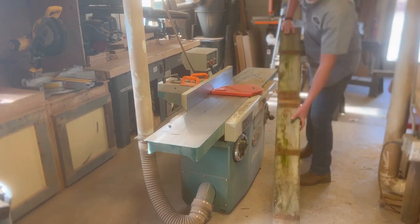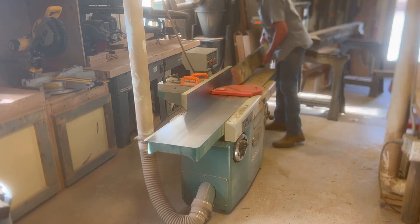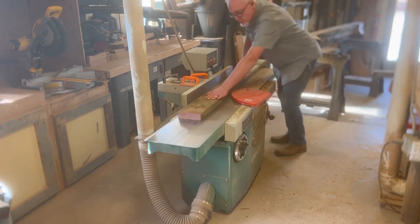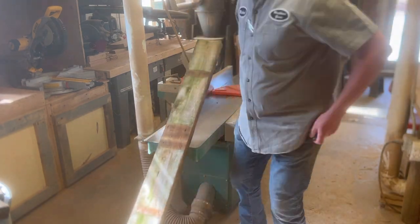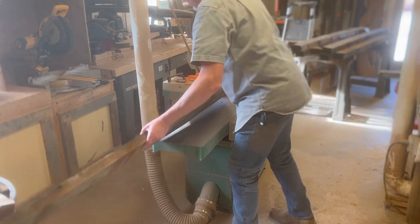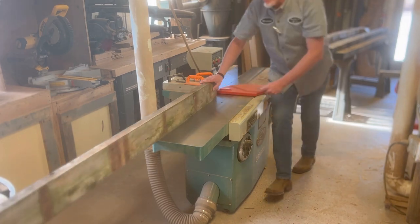You can see how rough they look here. Believe it or not, this used to be somebody's deck — somebody built their deck out of eastern red cedar. I'm not a huge eastern red cedar fan, it's just too red for me, but it's still a beautiful wood and it just blows my mind that this used to be somebody's deck. I'm doing this first board in real time so you can see the process, see how long it takes to get through one board, and you can see as it goes through the jointer how the bottom side is getting cleaned up. After I get that bottom side done, we'll move to one of the edges and get it straight and a good 90 degrees to that bottom. Then we'll run through our other 11 boards.